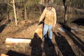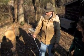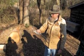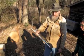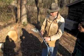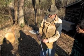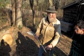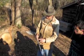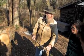Take the average. This particular log, I think, measured 19. There were 2 more lengths that long above this, and it was 12 feet long. I think it was 192. It might have been 20. But there's the length of the log there. This is the diameter, and this is the alleged board feet on the Doyle log scale.